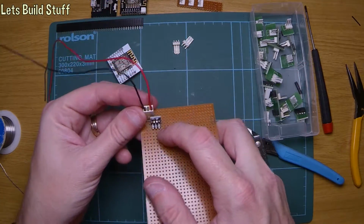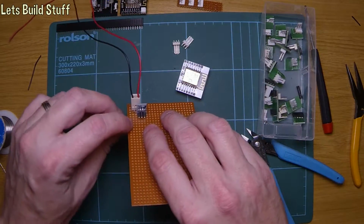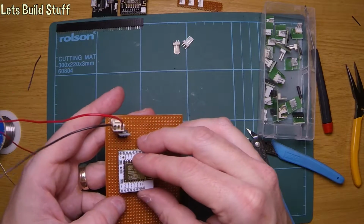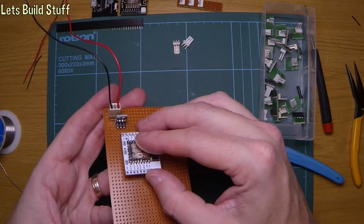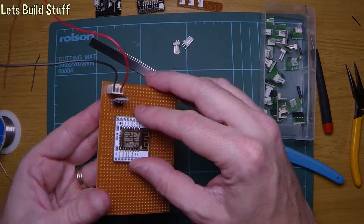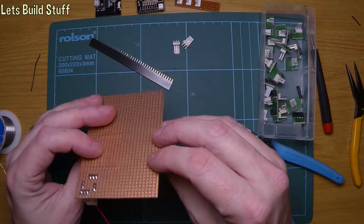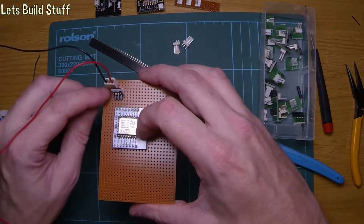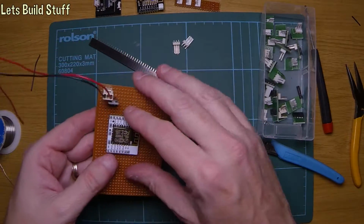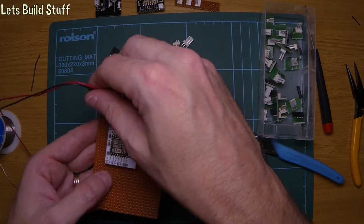the ground. So we can use either the ground that's actually on the regulator to go to this ESP chip, or the actual ground straight across. Obviously when I'm putting this in here, I'm probably going to put it there, obviously not straight in. I'm actually going to use the pin headers, and then cut the tracks so everything's safe, and then just use the ground coming up this way and across to the ground on the ESP chip. So I'll get the pin header soldered in next, because then I can work on getting all the cables sorted.